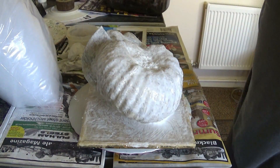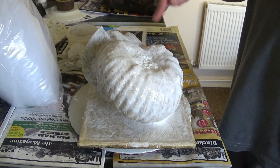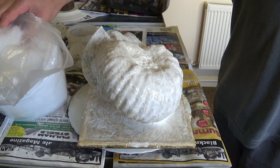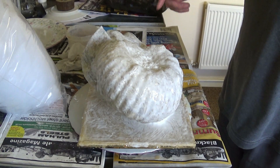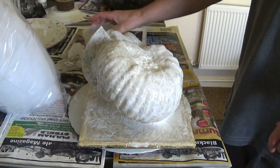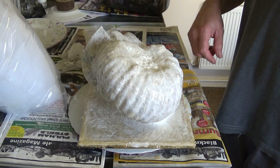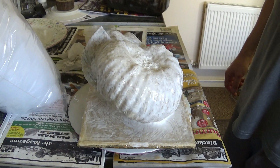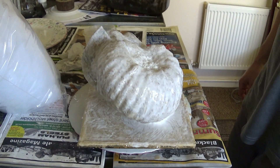I've got a fan going to help dry the latex. During the molding process I use some of this fiber here — which is a good tip from the folks at diymolds.com, so thank you for that advice. You can soak the fibers in latex and then apply them to the mold. I tend to put a layer of latex down, then soak the fibers, stick them on top, and work it in with the paintbrush handle. We'll let that set and I'll do another video to make the fiberglass mold, and like I say — casting and paint jobs.